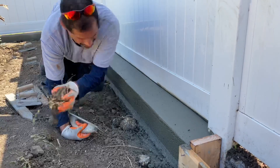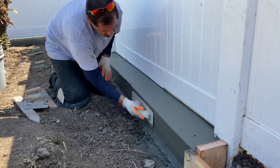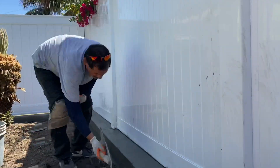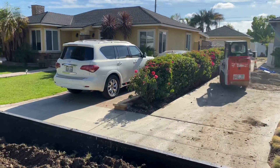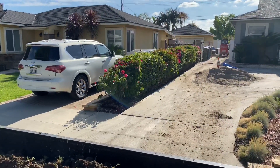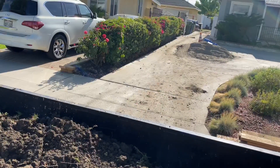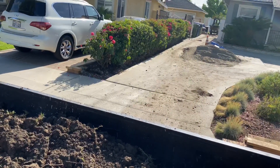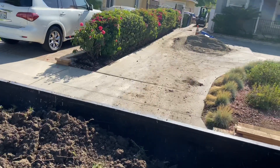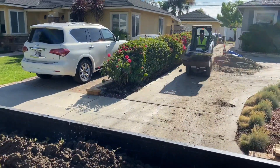Xavier there edging it up, finishing it up, giving it a nice look. After the curb was done we called in a bobcat and excavated some grass out of the rear of the backyard because the elevation wasn't quite level. There I am driving the bobcat, loading it up in our trailer.